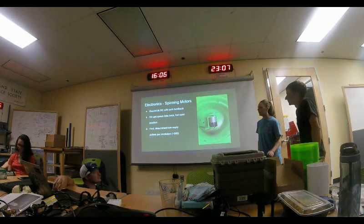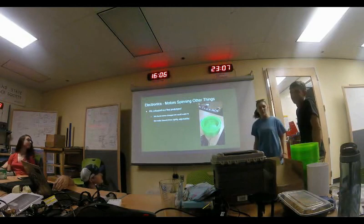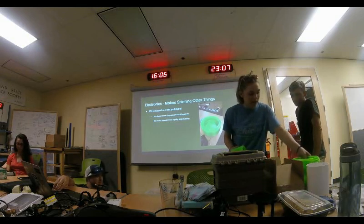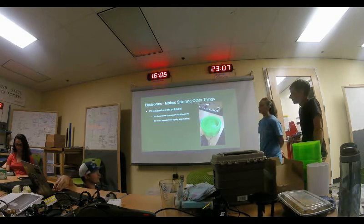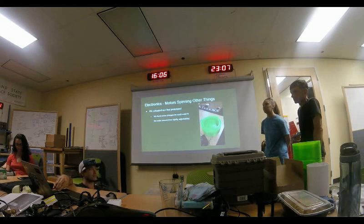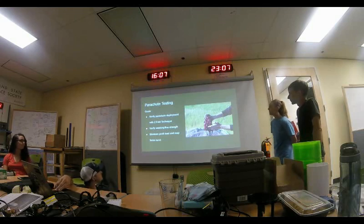Testing the motor — our first 3D print was one that doesn't really like to move; the second one moves well. The final pinion gear and twist coupling differ from those prints because figuring out internal spur gear math was more challenging than expected. Premier Gear donated the final parts and basically said they'd make something that works, so we got final specs from them.